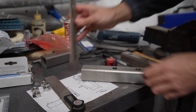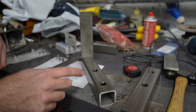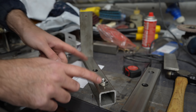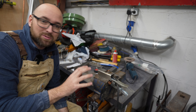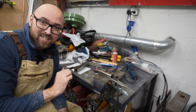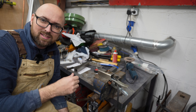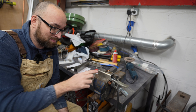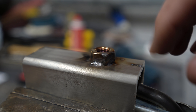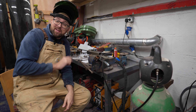The adapters are coming along nicely and you can already kind of see what they're going to look like. The idea is that this square tubing is big enough to slide over the arms on the solar arch, and then I'll weld these nuts onto here and have some bolts just go down and tighten it into place. I figured it'd be a good idea to do a little bit of practicing because it's been a while since I've welded and I am by no stretch of the imagination a good welder. The welder here doesn't have high frequency start, so you have to do a scratch start, which is just a little bit more complicated. I got too much heat into the nut and not enough into the square tubing, but other than that I think that's a decent weld. Let's go for broke and get these nuts welded on — this is potentially going to be very ugly.